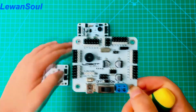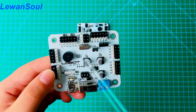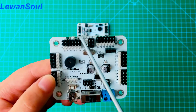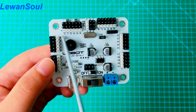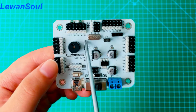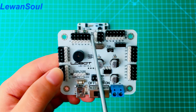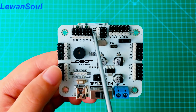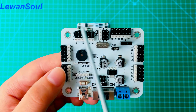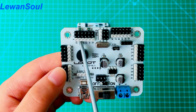The only difference between these two boards is that it only has six overcurrent protections. For this board, servo interfaces 10 to 15 have overcurrent protection. So if you are using servos, I would recommend that you stick to these six pins, because it's a much safer choice.